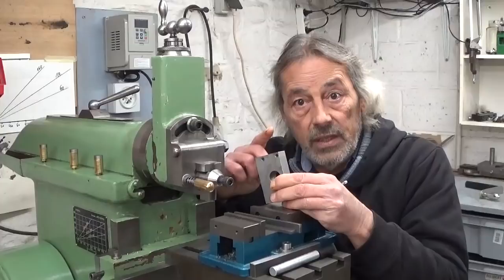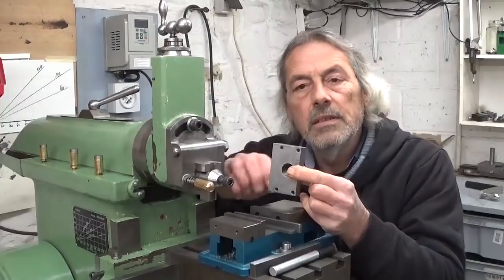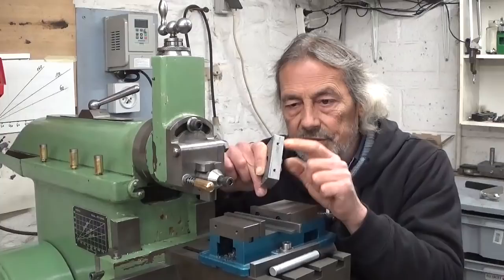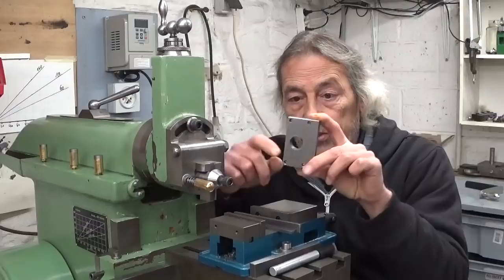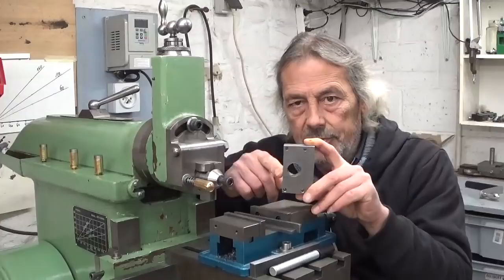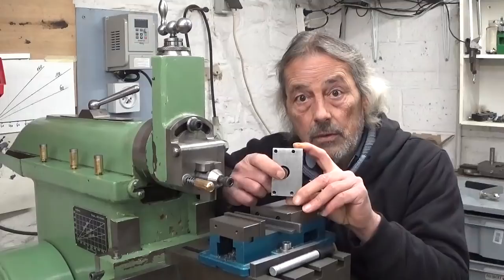Then I go to the drill press, make these 4 little holes in here. While I'm there, make again another setup to drill and tap these 2 little holes in the side. Then I mark out the bigger boring here, go to the lathe, put it in a 4-jaw, center it, because you see that the boring is not in center of the part, so I have to install it in a 4-jaw eccentric and then drill and bore this opening. That's a lot of work, a lot of setups.